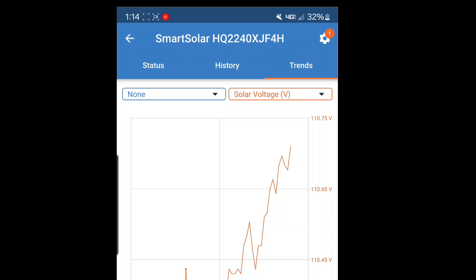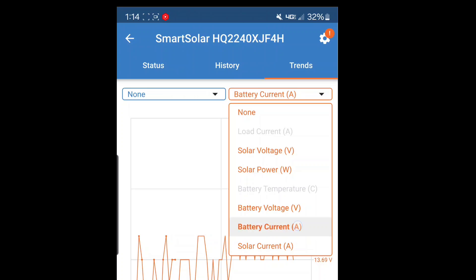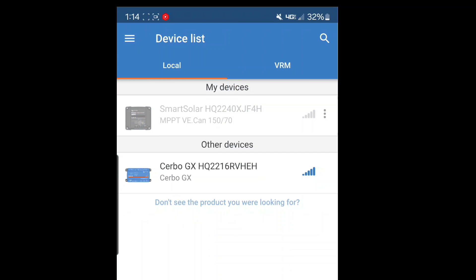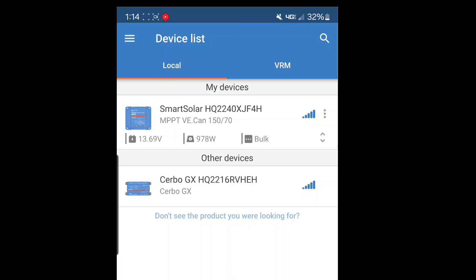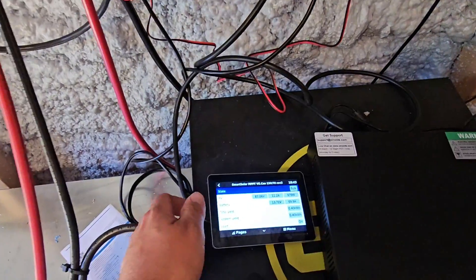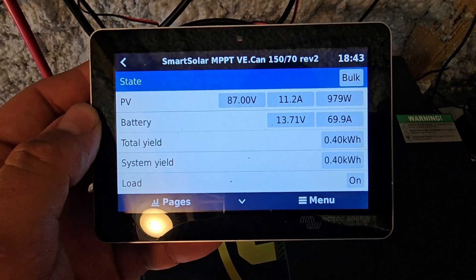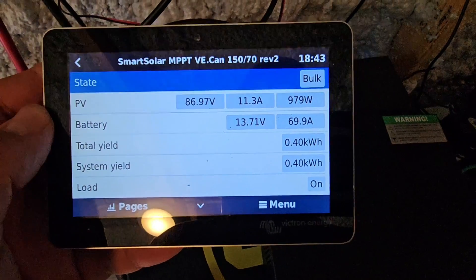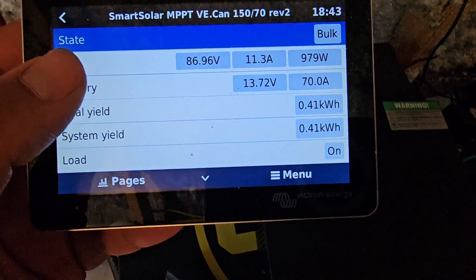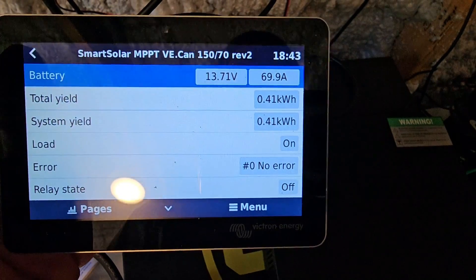You can see what's happening to the voltage — is it going down, is it going up? Right now it's going up. You can click to check out the battery voltage and battery current. This is an awesome tool. This is why I love Victron Energy's smart solar charge controller. I also love the Cerbo GX — I've got that VE direct cable connected and now you can see we've got PV: 87 volts, 11 amps, 979 watts, battery voltage, battery current, and total yield. No errors right now. Pretty cool.